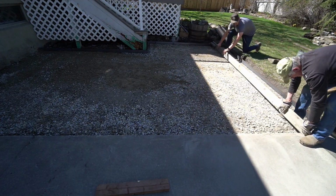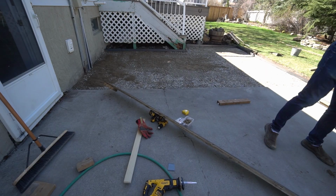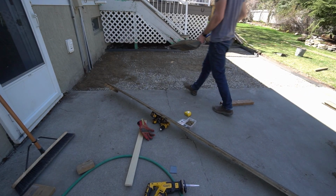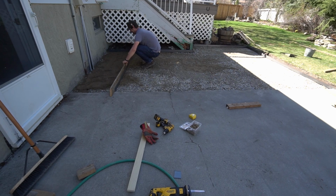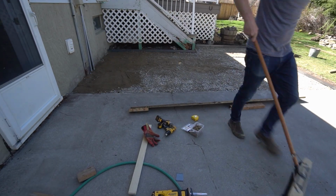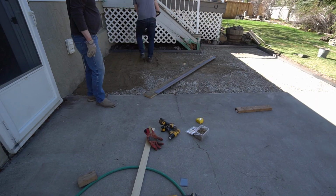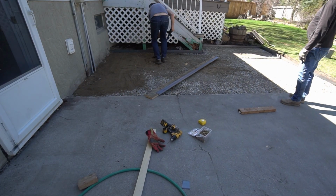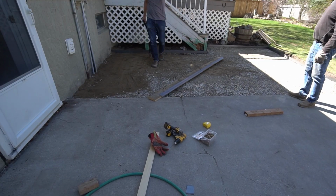With the width of this section, 2 people made sliding the board so much easier. Since we only needed a little bit of sand to get the correct level, I started by sprinkling it with a shovel. Obviously, I needed much more than that, so in came the wheelbarrow. I had hoped our scraping got rid of the high spots, but there were several that needed rocks to be taken out by hand. Instead of picking them out one by one, I just tossed the sand that had gravel mixed in. We had lots of sand, so to lose it wasn't much of a concern.